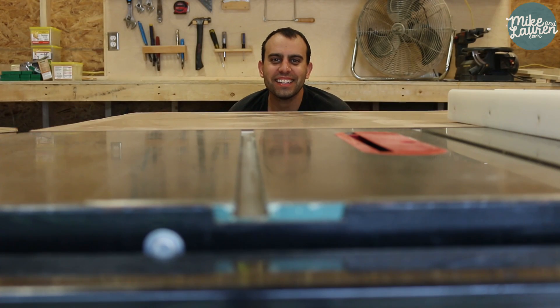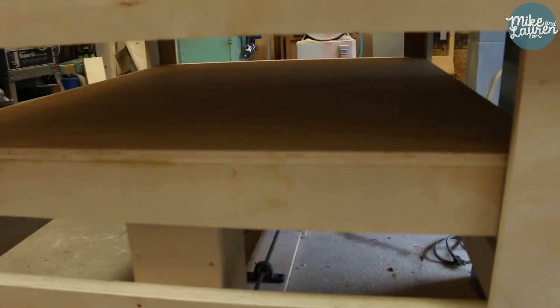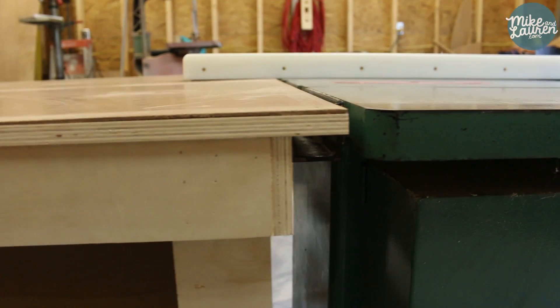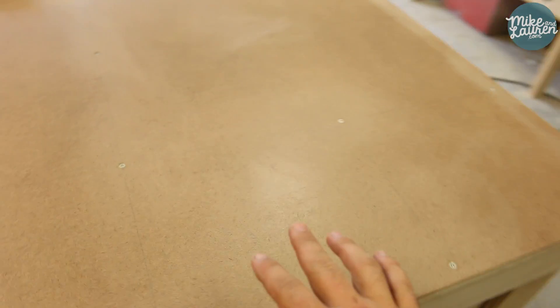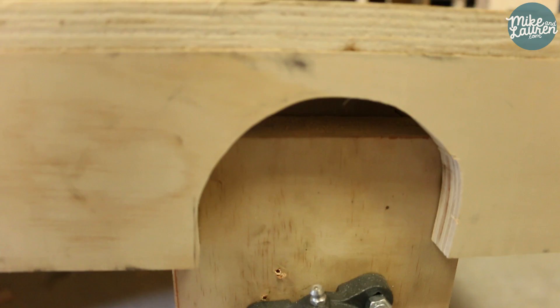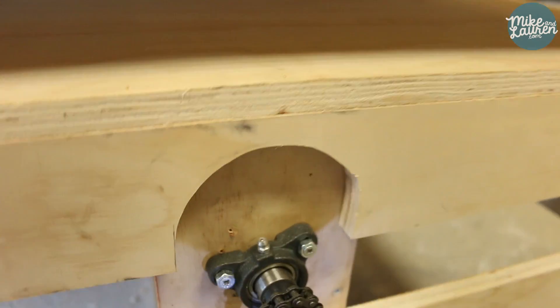All done — what do you guys think? I think it turned out great, everything went according to plan more or less. There's the middle shelf where the CNC will go. I did a little bit of shimming to try and get these level, but I'm gonna have some more work building up the table saw just a little bit. It's really solid — the top is gonna be a really nice work surface. It's really solid both front to back and side to side. I cut out a little too much here, so I'm gonna cut this little piece out and replace it to fix that.